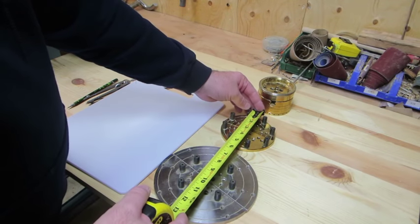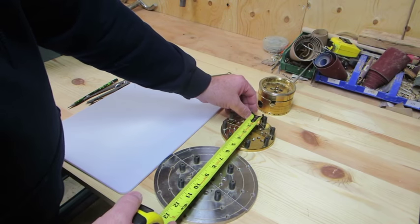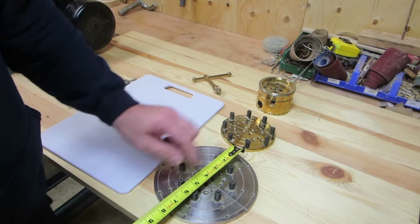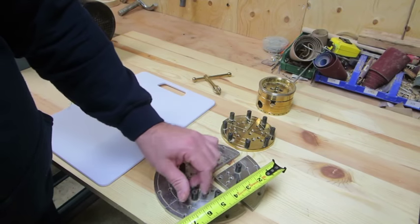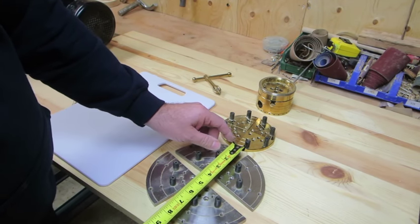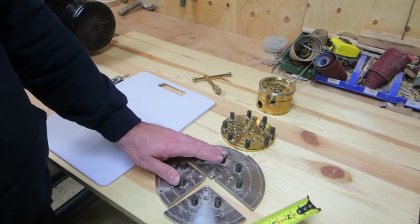Okay, so this is showing you the set that the Barracuda chuck came with. And as you can see, it's about 4 inches. You can get something in there about 4 or 5 inches at the most, nothing bigger. This set, like I said, is about 7.5 inches, and as you expand the jaws on the chuck, they will increase by a maximum of 1.5 inches. So you're going to get something maybe 7-8 inches at the very most in these cold jaws.